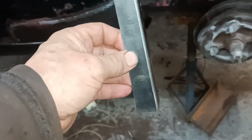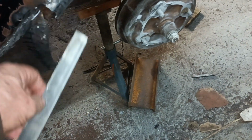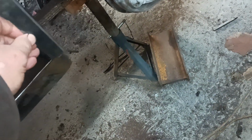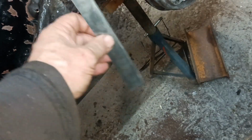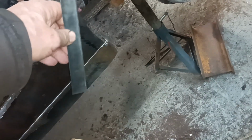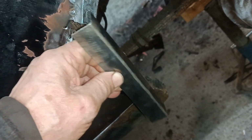Okay, probably going to make a rod for my own back, but I'm going to try and document making this piece, which will go there. It'll go from there to there, like that. So I'm starting off with this piece of angle. So you've got to imagine that coming down to there. Now, basically this face, if we call this the outside face, that's got to be stretched to force it round into that radius like that. And then this inside face has to be shrunk to bring it, so it starts off like this and then comes in.